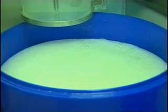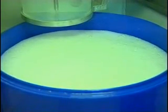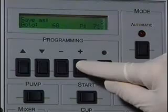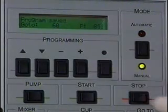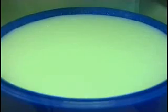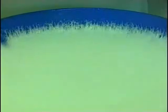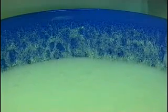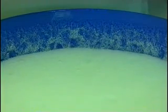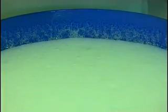To prevent the silicone in the bucket from overflowing, the sawtooth function is started in the automatic mode, and the maximum extension of the silicone is limited by pushing the Enter button. The subsequent evacuating and flooding is done automatically by the vacuum chamber so that the degassed silicone can be taken out of the chamber after half an hour.